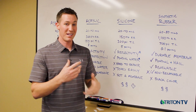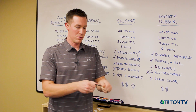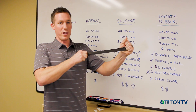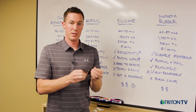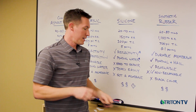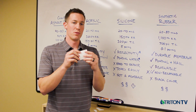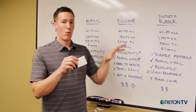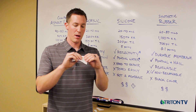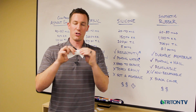Combined with an acrylic top coat, you can achieve reflectivity, sustainability, and continually renew the life of that roof indefinitely. The synthetic rubber on its own shows high elongation and recovery combined with tensile strength, making it very difficult to pull apart. Fully adhered to a roof, the combination of flexibility and tensile strength makes a big difference. The acrylic top coat splits under any stretch, similar to acrylic applied directly to a surface with expansion and contraction.